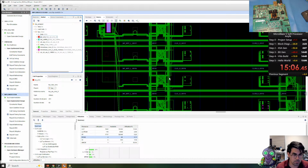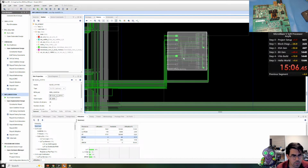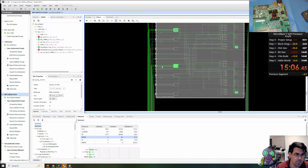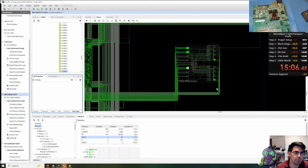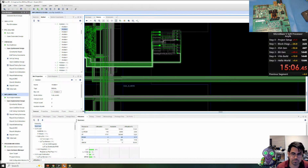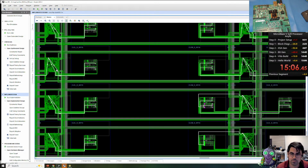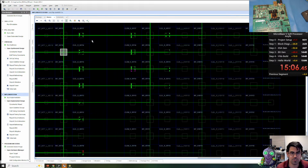And we can zoom in, look at one of these interfaces. So this is our logic slice. It includes 6 LUT 6s, or no, is it 7 LUT 6s and twice that many flip-flops? No, it's 8 LUT 6s. I can't see that one right there. 8 LUT 6s and 16 flip-flops. And you can, once again, click on these. If you go to the LUT, you can see the cell. Yeah, here we go. We can see the, oh, not on this one, it's hidden. But we can follow these nets through the routing mux over here and see how it goes through the design. I want the routing mux, not a net. There's our routing mux, and there's the various nets in here.